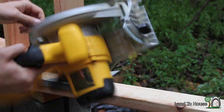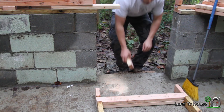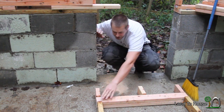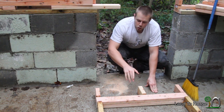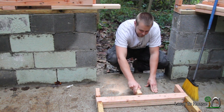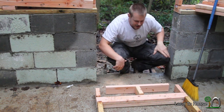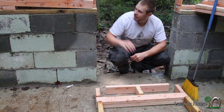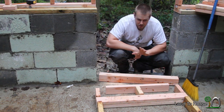The new and improved measurements are 32 and 3/4 inches. I realized that piece was too short, so I cut another header board and reattached it to my treated side pieces, which are jack studs. Now I want to install my window above this, which is going to be 30 inches by 36 inches. I'm going to add these little boards here, and then there will be another board up on top, which gives me the area I need so that my window can sit up here. And then I've got another header board that will go at the very top above the window, and that should make this door and window framing complete.